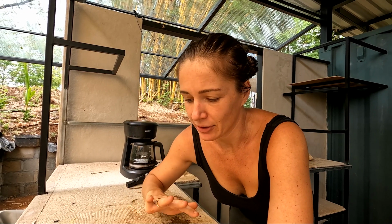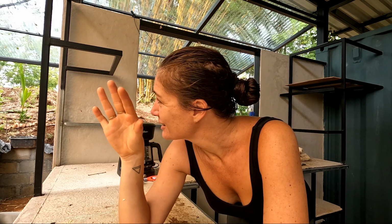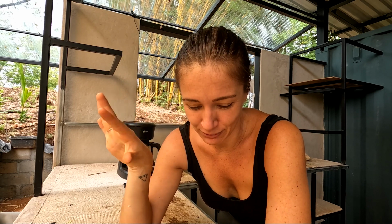I think the issue I've been facing is I've been trying to make it look perfect while it's still wet, and technically you shouldn't really need to do that because you can take a sandpaper and sand it down, and it will also create that nice finish for you. So I'm gonna rather do that and then hope to God or somebody or some mighty force up there for some beautiful concrete counters, because I am very nervous about it.